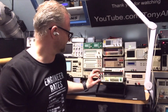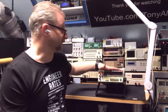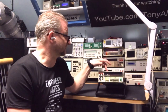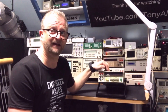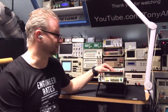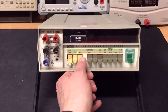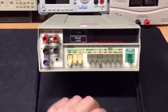The difference between the 8800 and the 8810 was not that big. With these multimeters, if it has no options it only comes with DC voltage, then you have an option for AC voltage and an option for the ohms/resistance. The tiny difference — because the modules are interchangeable — is that the ohms module in the 8800 was completely isolated with batteries, while the one in the 8810 was without. This unit only has the DC volt option, so the switches are locked and you really cannot push them without breaking them.